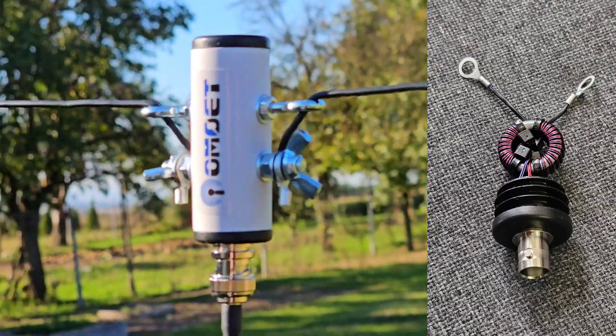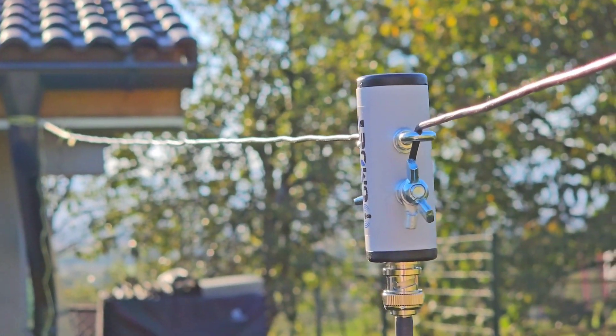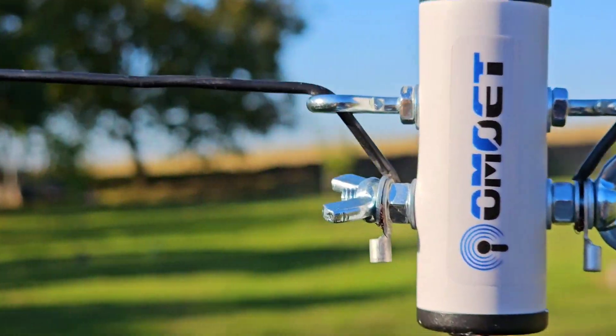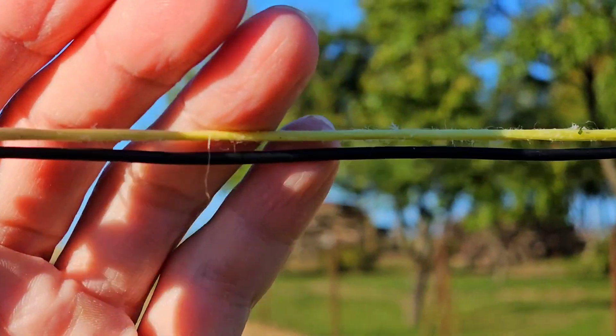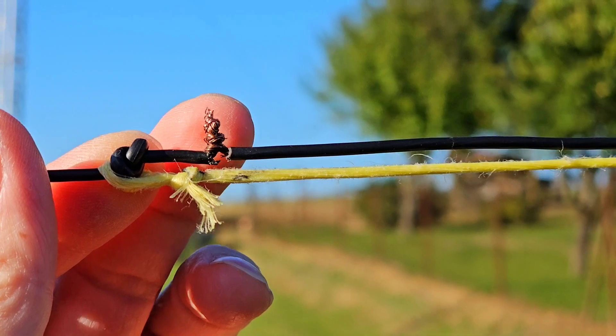This is currently for the 20 meter band, so I have 5 meter long wires on both sides, cut in the middle. If I disconnect both wires, I can get 10 meter band.